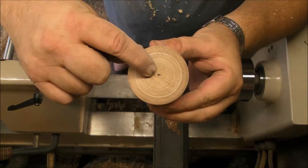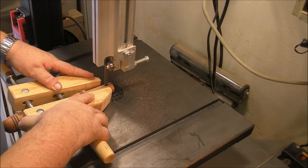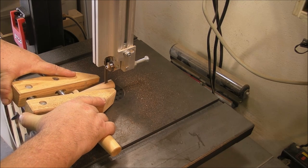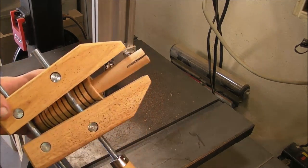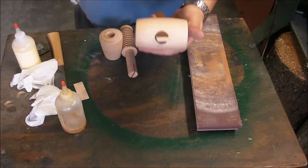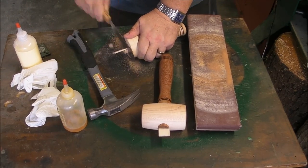As you can see, there is a little hole where the end of the Forstner bit left its mark. Now we are going to cut the handle to have a place to position the shim we are going to use. For that, you have to hold the handle with a clamp because you don't want it to turn in your hand — it can be a problem with the bandsaw, so it's much safer if you hold it with a clamp. Now it's just a matter of inserting it. I'm not going to use any glue — just insert the shim on the top, hammer it, and it's perfectly tight. It's not going to go anywhere. Then use a flush saw to cut the excess and you are ready to go.